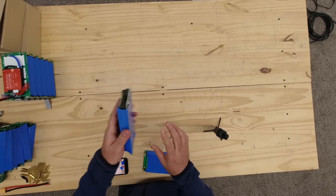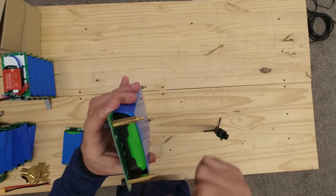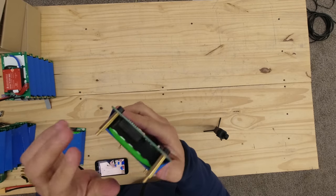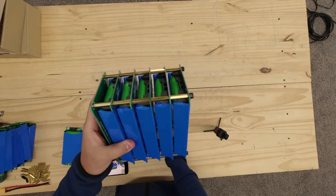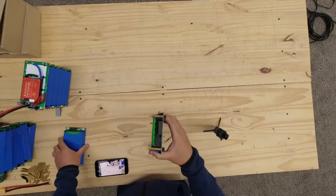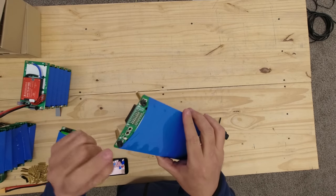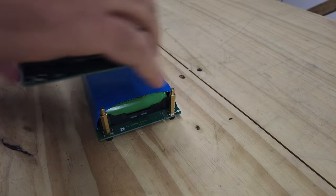You start with one module. These little guys are brass standoffs, 25 millimeter long, and these are used to put the entire assembly together. They also electrically pass the power from one board to the next. At the bottom you start with nylon plastic standoffs because these are also isolators — you can isolate the bottom of these boards so nothing shorts. You start the board like this, then add a second one on top.